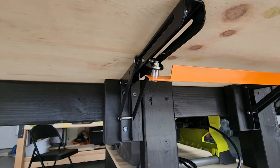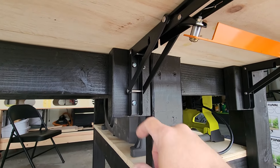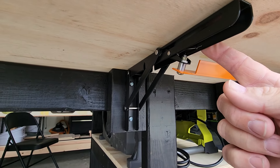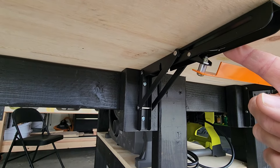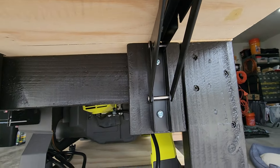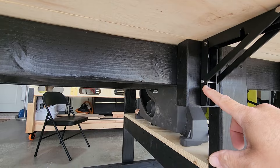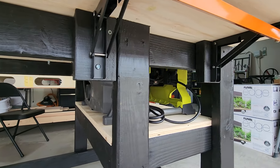All I've got to do is put one hand here and one hand on the other one and the table will fold. I'm going to take off a couple of these brackets and trim the screw holes with the Dremel because these things measure like 92 degrees instead of 90. I got a bit frustrated and just put the table upside down and screwed them on anyway — it worked out, the table was actually flush despite the extra two degrees. But there's a slight mismatch on two spots, so I just need to enlarge those holes, slide it down, and screw it back in.